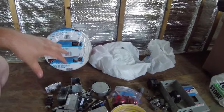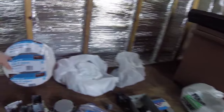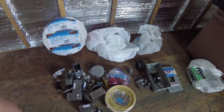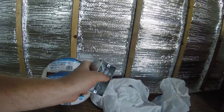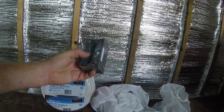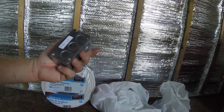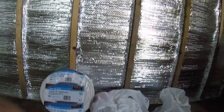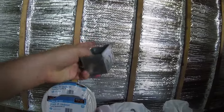I knew what those wires could handle, and all the interior stuff is just going to be for the 15-amp breakers — for all those switches and lights. I knew I just needed these electrical boxes. I've seen them before — you mount them in the wall with a nail or screw. Since these are metal boxes, and they do have plastic ones, but these were available at 25 cents each. You do have to ground the wire to the metal box before you put it on the green ground on the plug — put a screw right in there.